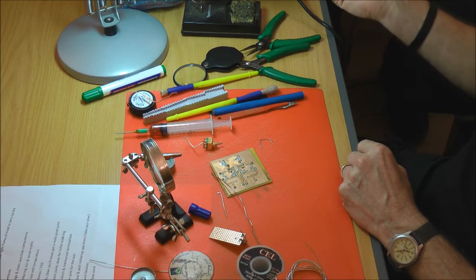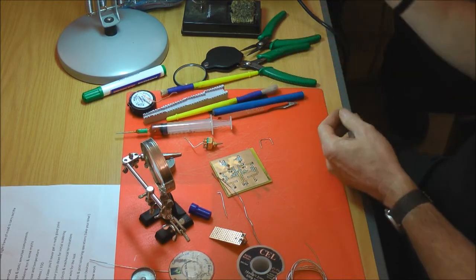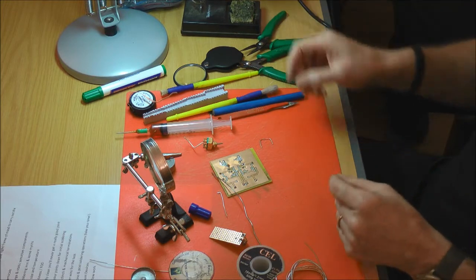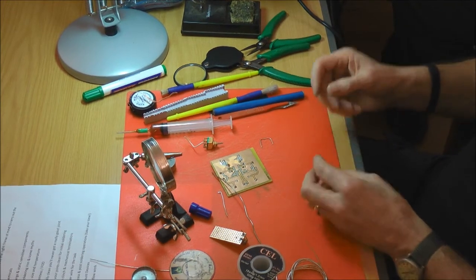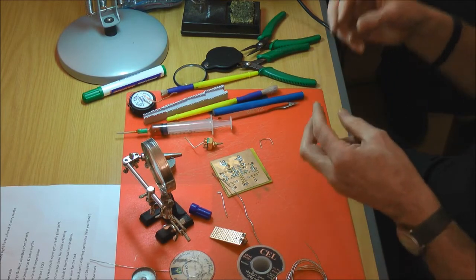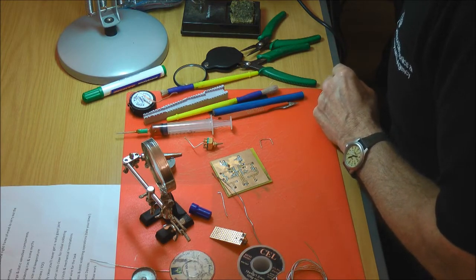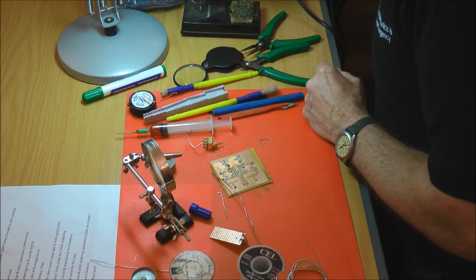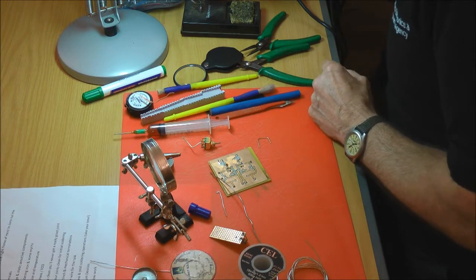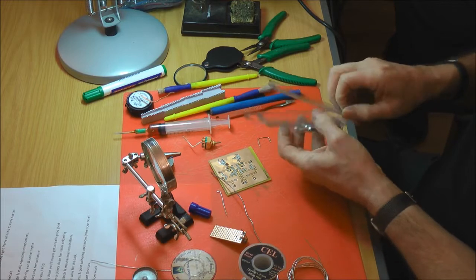This one is a 25 watt Antex. I did have a 15 watt Antex for ages when I started doing more integrated circuits and things. I got really frustrated with it because you couldn't really get the heat into the joint, and I found you're dwelling a long time. Well, the Weller was like 48 watts or something. The Weller's a very good iron.